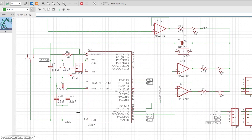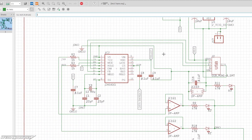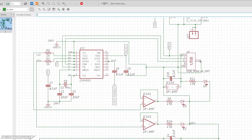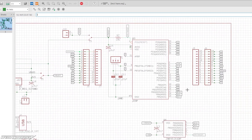This project started by sketching out the circuit diagram to meet my requirements. First I made a bare-bones Arduino with the ATmega328, including the required passives like resistors and capacitors, an oscillator, and the serial communications chip — the CH340G — along with a USB jack for easier programming. The DTR signal from the serial chip is what makes the microcontroller ready to receive code. Without this, the ATmega wouldn't be programmed. I made sure to only connect the DTR signal to the target and not the master.